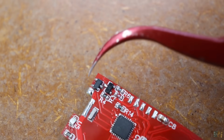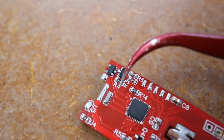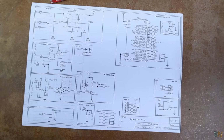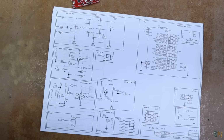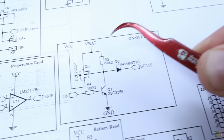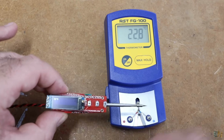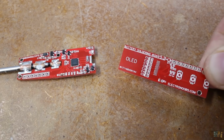And then these other MOSFETs here are for turning on the circuit, because if you check the circuit, you can see that I have no switch. I want to use this latch system to turn the PCB on without any switch, just one of the push buttons. And these buttons and the screen are on the second PCB.